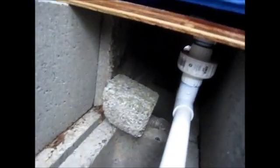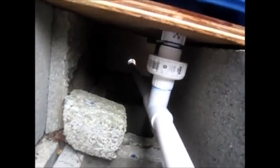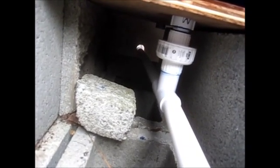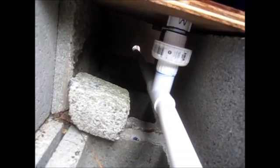Here's a barrel installation, fully installed. You can see how it's going through the fence and then running over to this fitting. There's a down slope to this pipe so that when I drain it, I get it draining in the right direction and don't leave any water in it.